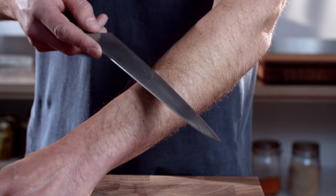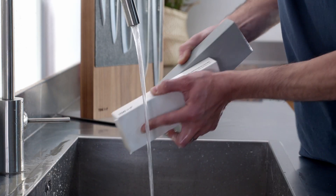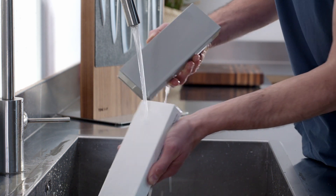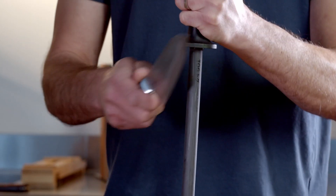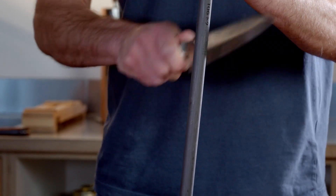After that your knife should shave hair off your arm. Flatten your wet stones by rubbing two together or rubbing one on a diamond plate, and remember to dry soaking stones completely before storing them. Maintain your edge with a honing rod or fine whetstone every week and you won't need to go through this process too often.